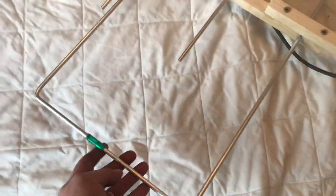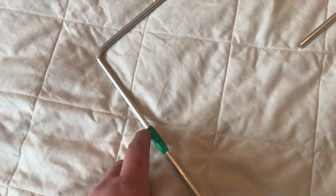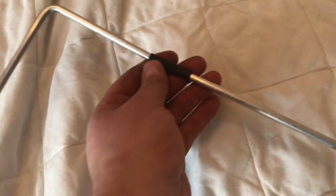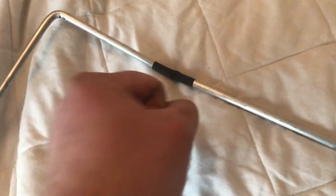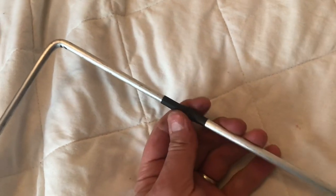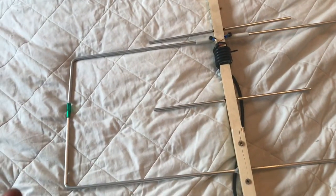The other thing that's not great is these little spacers — there needs to be a 14 millimeter space in there. What I'm going to do is use heat shrink: I'll get some wooden dowel at 14 millimeters, put that in there, then put the heat shrink over the whole lot and shrink it down. Right now it's all loose so I can pull these apart — that's why it's wobbly. The dowel in the middle will keep them spaced nicely apart.